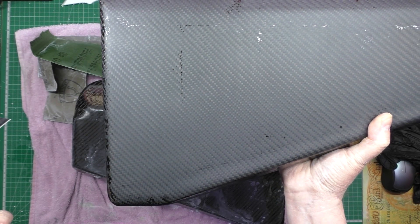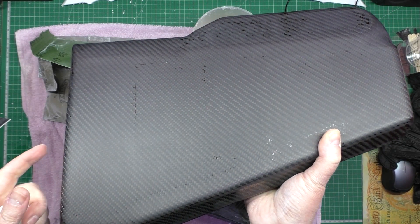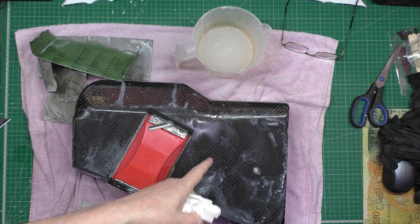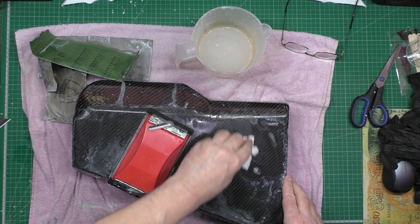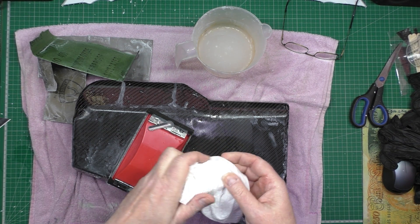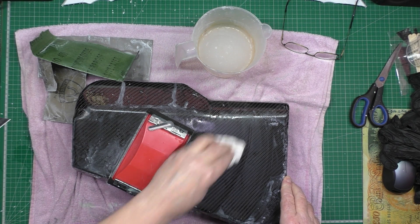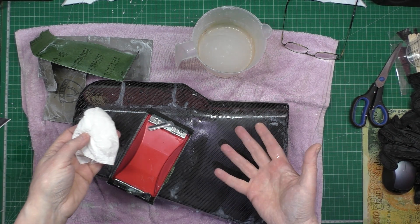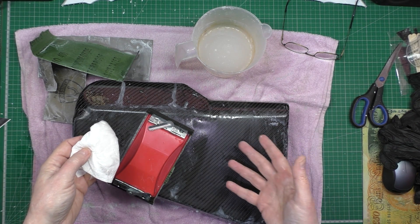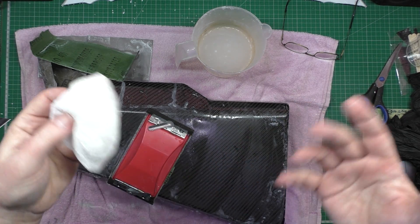I've had enough. This has had six coats and it's got to be polished up yet. That's done with 2000 wet and dry. This one here has also had six coats. With these coats you have to coat it, leave it 24 hours to settle, sand it down so you can see where the low spots and high spots are, coat it again, do it again, do it again. In between each coat you have to leave it 24 hours.